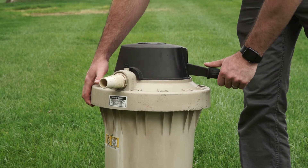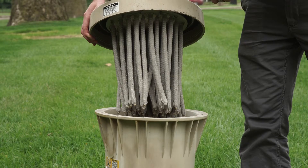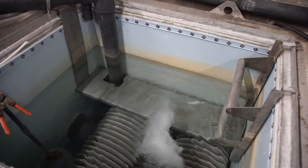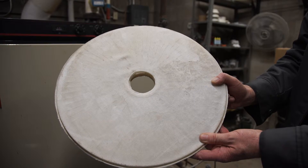When in drum form, the filter is on the pressure side of the pump with water pushed through the filter grids or fingers. These filters use diatomaceous earth powder that attaches to the grids or fingers within the drum or pit. When water flows through them, it is filtered and the water then re-enters the circulation system.